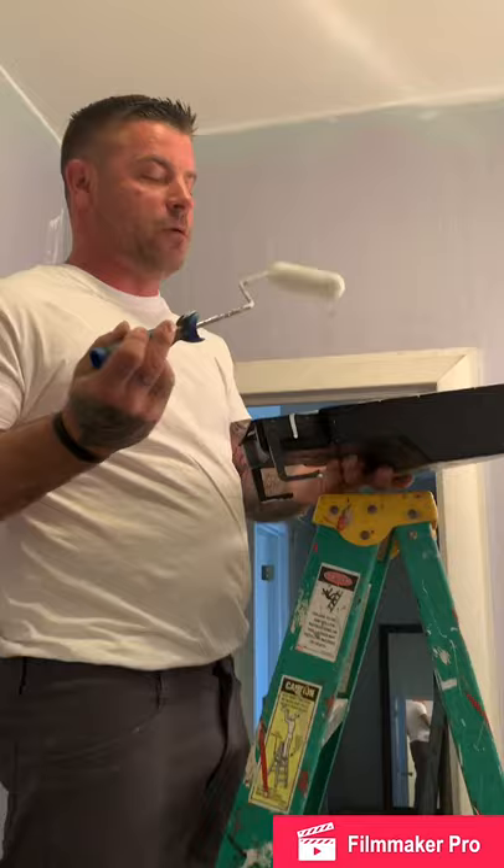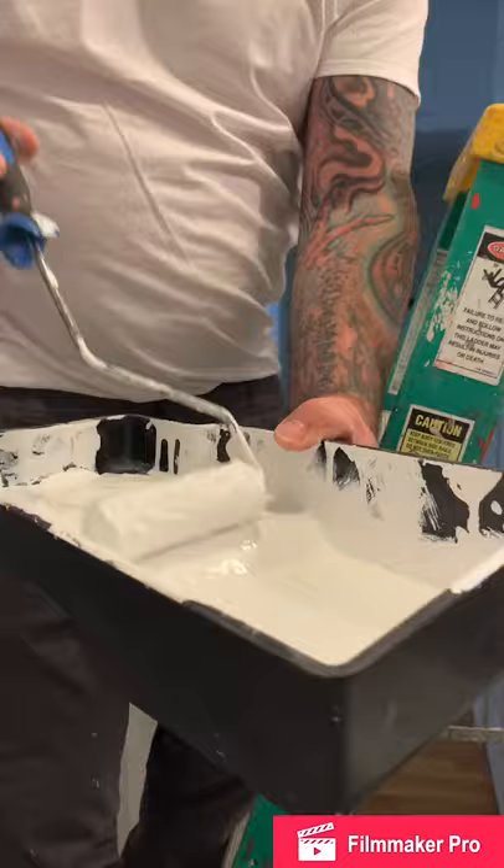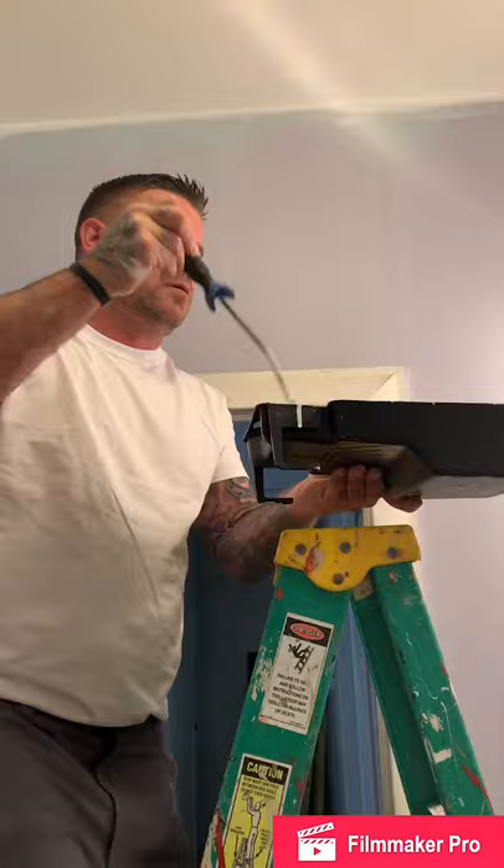All the way around, I'm going to take a 4-inch mini sponge roller and I've got my sealant paint in there. I want to get it wet, then roll off the excess paint. I'm going to start in one corner and work my way out, continuing that all the way around until I cover the whole sealant. So I've got the sealant all painted — all the edges are done and the sealant's dry.